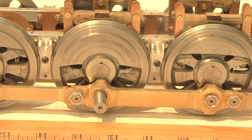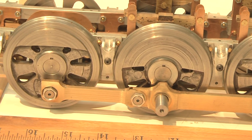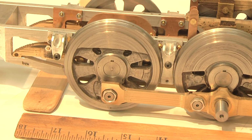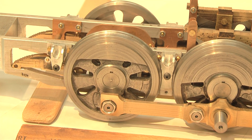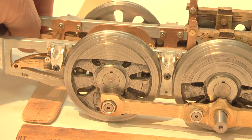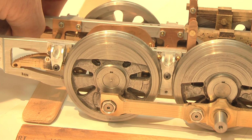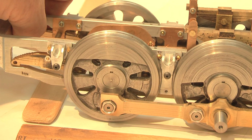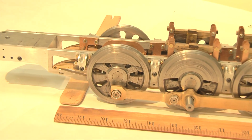And here's the main center rods. These are rods articulated, of course. There's three different rods put together here. That's the way they work in the prototype. But I wanted to show you also that I tried to be faithful in reproducing the articulation. If you just lift up on this opposite side of this spring, you can see that I've tried to carry it through the articulation, and this goes from one side of the frame to the other as well as along the length. So each wheel can be balanced to have the same amount of pressure on the rail regardless of the bumps in the rail. So that's what I did. I chose to try to be faithful in that.